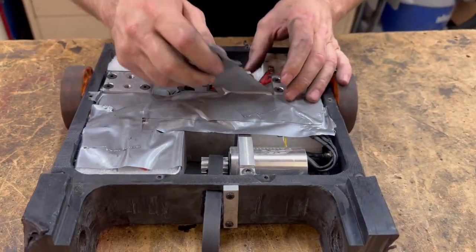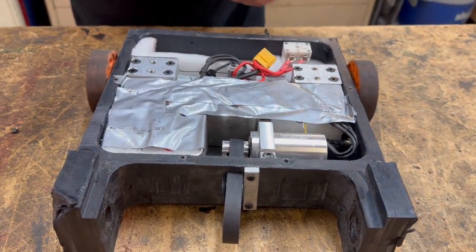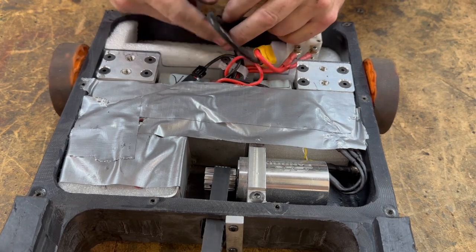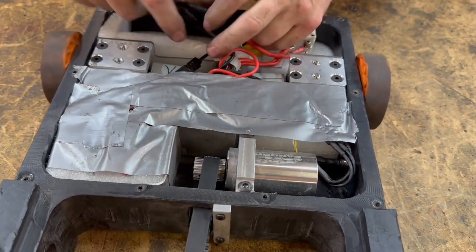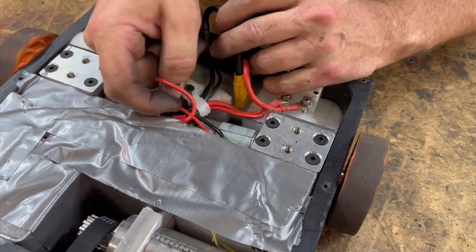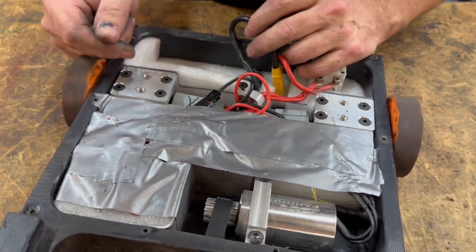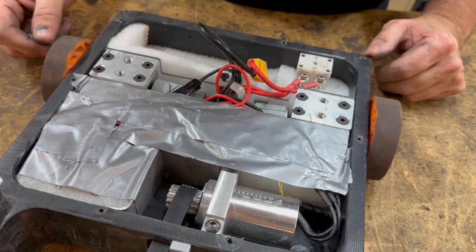Now, most everything is... Yes, I can immediately see what our problem is. They didn't do a very good job here. These motors, the drive motors, should have been both supported by the gearbox and then somewhere in the back to hold them up. And you can see that both of these drive motors have popped away from their gearbox. They're no longer, like that one's not even attached at all. This one's loose, and that one's not even attached at all. So it's clear to see why it stopped driving at the end of the match.